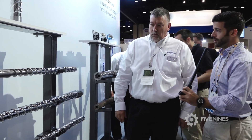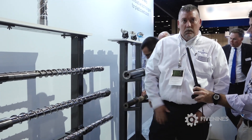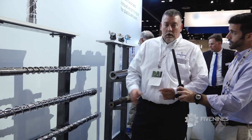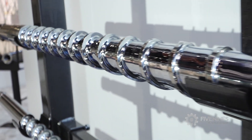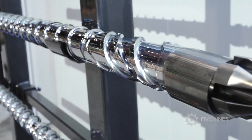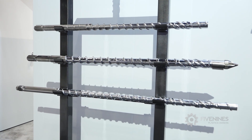So even if they're not necessarily mixing color, it's all right? Absolutely. We've got a process in polycarbonate where the Eagle Mixer, with that homogeneous melt — it's a no-shear mixer, so what that's doing is taking all the air bubbles and the stress in the plastic out before it's molded, and you're getting crystal clear, optical quality polycarbonate parts.